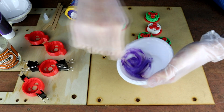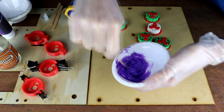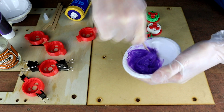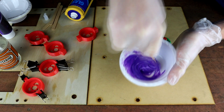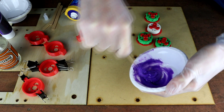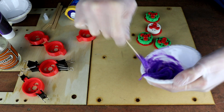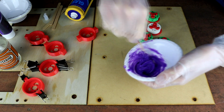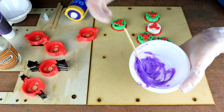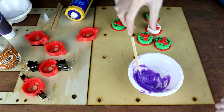Now the paint doesn't actually do anything. It is just to show you when you've actually got the mixture correctly mixed. It's the glycerin that starts the reaction for the silicon, but I don't actually think it does anything beyond getting the reaction started. Once the reaction's going and the silicon is cured, that's just that, and then the glycerin evaporates out or something. I don't actually really know, to be honest. But it doesn't affect it all that much. I've definitely put too much glycerin in before, and it does thin the silicon a little bit, but not enough to make huge amounts of difference.